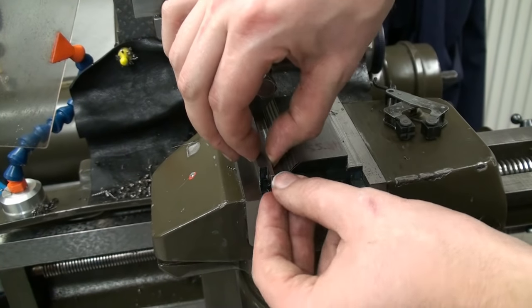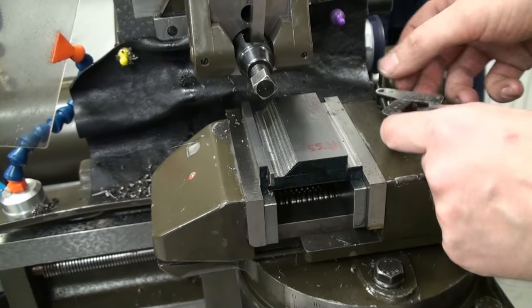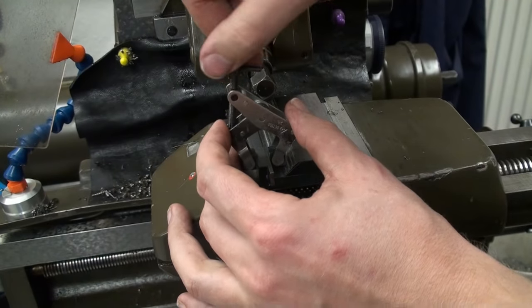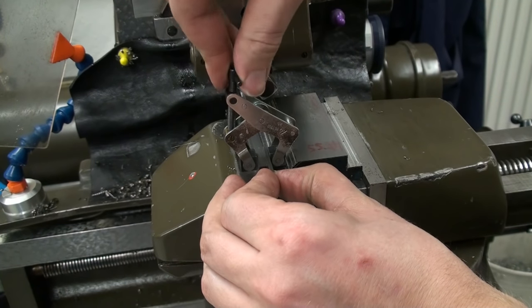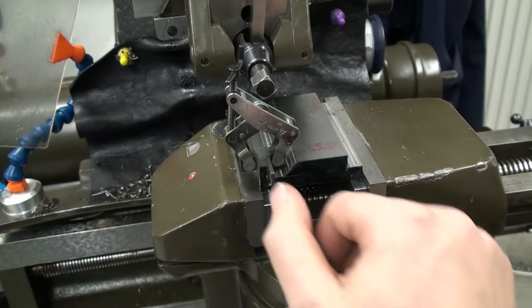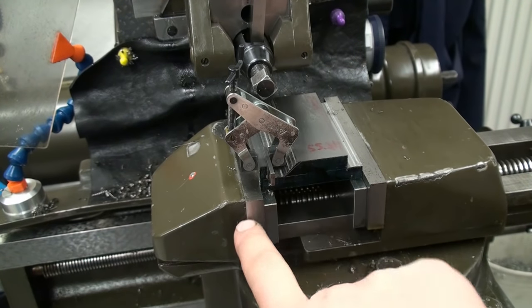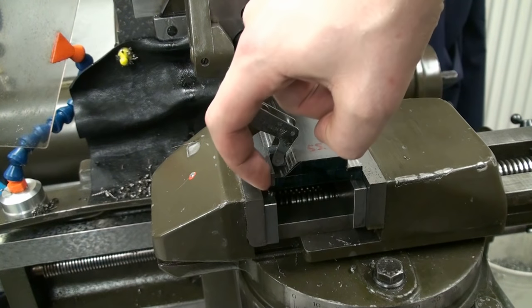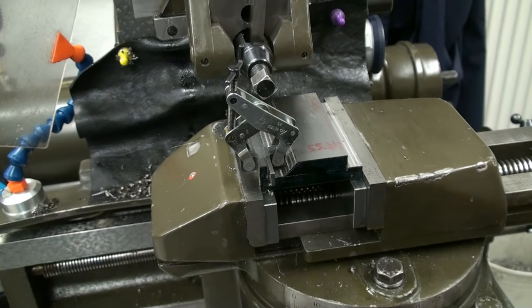And we will get it against the vertical wall here and take a small clamp and clamp the gauge block against the surface. And now, see what we did? Now we extended the surface and changed the orientation. Now we can measure from this side against the surface.